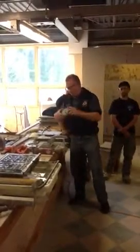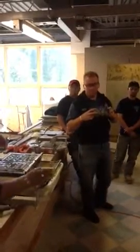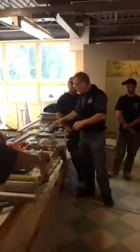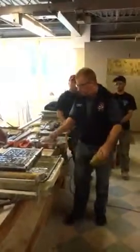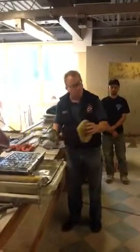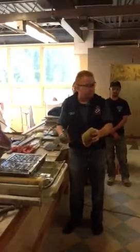You're going to make sure that you have proper PPE, with the proper cartridges, and that this has been fit tested. Okay? If not, you're not working with it. If you do not have PPE, you can take a sponge, and as you're working with the hand grinder, you can hold the grinder and hold the sponge against the blade. Keeps the blade cool, longer the blade lasts, and limits the amount of dust that gets kicked up. Okay?